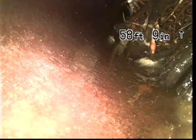Now, I was told years ago, one way to help with roots is to pour bleach down the line periodically, a heavy concentration. If those roots seem so high in the pipe, how would the bleach ever hit them? Normally, roots grow in from 9 o'clock to 3 o'clock. That's how they hang down there. The thing is, to introduce any liquids or chemicals, we're out 60 feet.